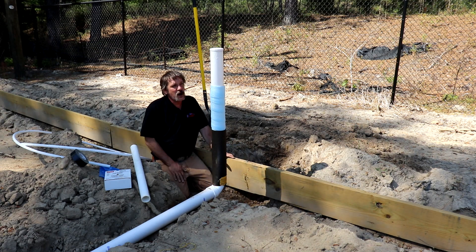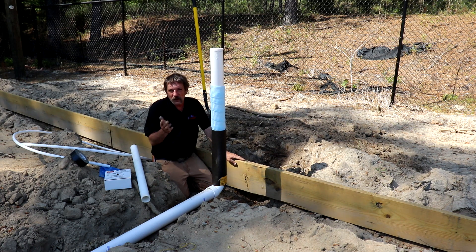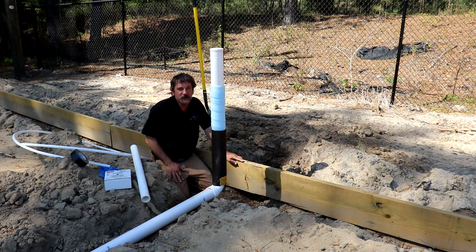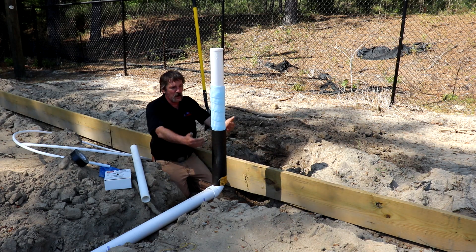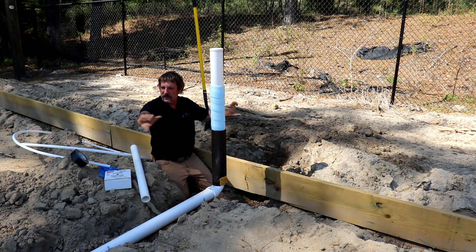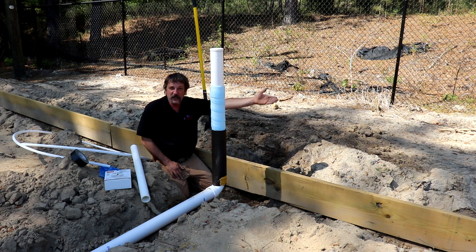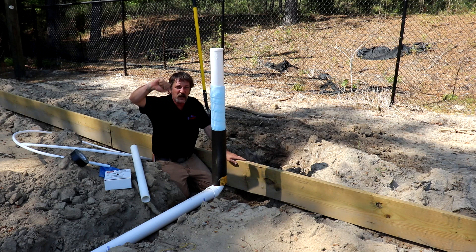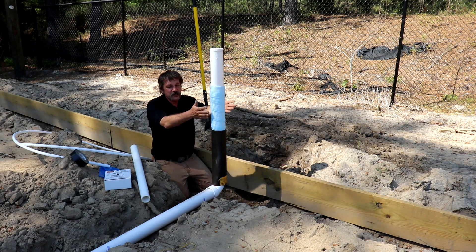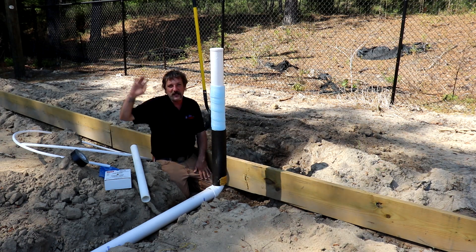So this is a drop for our upstairs. This one's actually in a 2x6 wall according to our plans, but sometimes your drop might be in a 2x4 wall. So when you're coming up with your water lines you want to be on either side. Remember this is the garage wall — our water heater is probably going to sit right here. We typically use the tankless external heaters, and in the garage we're going to have a main shutoff. So this is a good place to bring in that entry and then we can feed the water heater and the rest of the house.